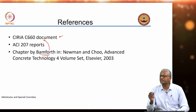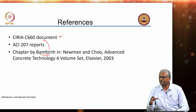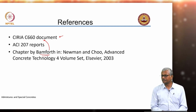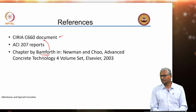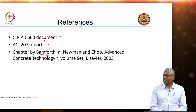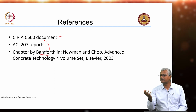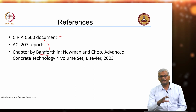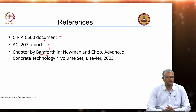So there are these polymers, when you add to concrete, they take in a lot of water. This water gets slowly released over the time of concrete hardening or over the time of concrete strength gain. So there is internal release of water, which sort of reduces the overall pore pressure that is caused by autogenous shrinkage. Internal curing can also be attempted by using some lightweight aggregate in your system. So lightweight aggregate also highly porous, it's going to absorb a lot of moisture and release it slowly for internal curing. Only problem is, when you are using high strength concrete, when you use lightweight aggregate, it will cause a drop in strength. So even super absorbent polymers may lead to a drop in strength. You have to do a proper design in such an instance. So it's not easy.